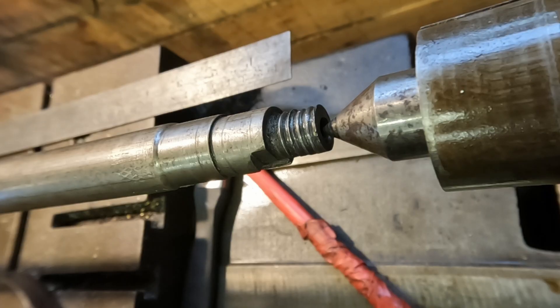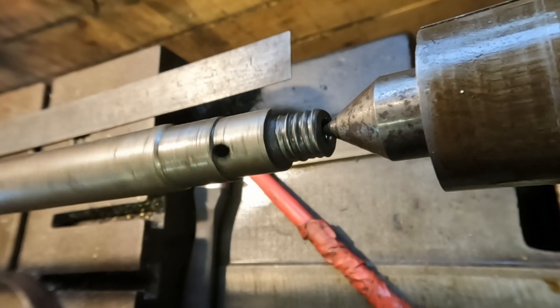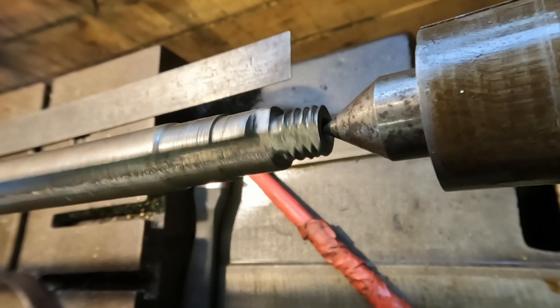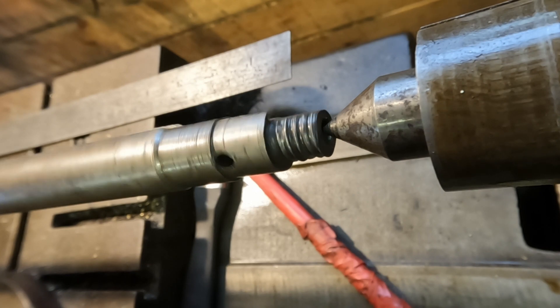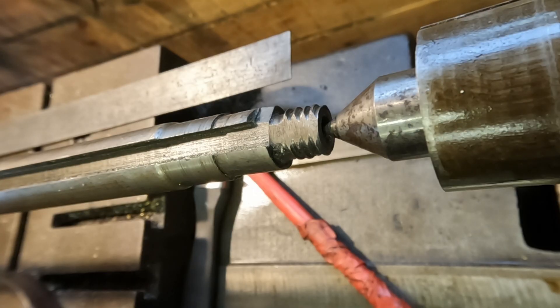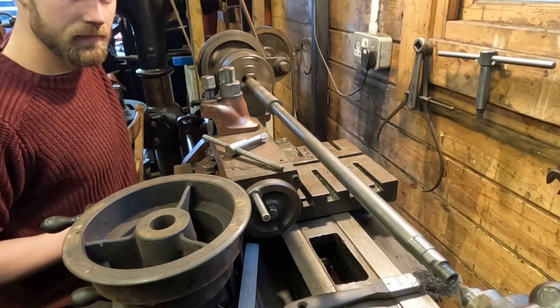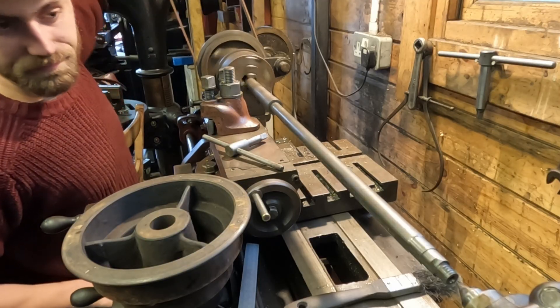After a good five or six passes of toing and froing from the lathe to the fly press, this is what we are looking like now. You can see visually against the dead center in the tailstock — that is a lot better than it was. There is still some runout so I don't think it's dead straight, but we're looking at comparative runout here — remember the other end is only in the three-jaw, it's not a hundred percent concentric. Using a DTI here is chasing precision that I don't really have anyway on this part, so I think this is probably as good as we can get it. That's a lot better than it was. I'm quite pleased with how that went.